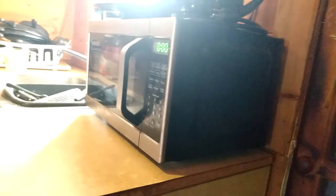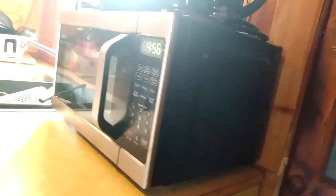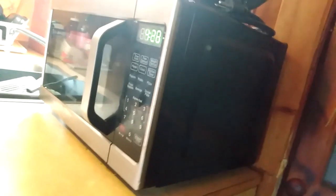My main purpose for this is to run my microwave. Can you run a microwave off a small solar power system? Absolutely. This microwave uses about 950 to 1,000 watts when running, and it's plugged into the inverter. Most of the time I'm only running it for five minutes at a time — heating up burritos, chicken strips. Even if I want to cook a meal, as soon as I turn it off the solar panels start recharging the battery. I can use it three or four times a day. If I'm cooking something that takes 15 to 20 minutes, I can still run it fully off that 200 watt recharging station. It works perfectly.